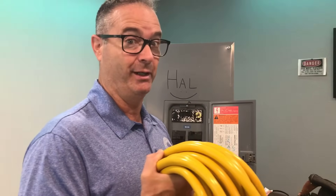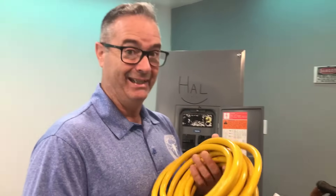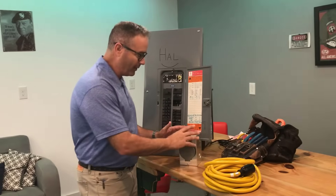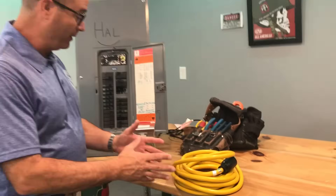Well, how can it be lost? It'll be in my garage, probably. Here's my definition of lost: when you need it and you're panicky, can you find it in less than a minute? If you can't, it's lost. Second part about the cord — get a longer cord than you think you need. For God's sake, don't be cheap. I have so many people who say, I want to save 50 bucks, I'm going to get a short cord and just park the generator right next to my inlet. My point is probably not. Where the generator has to go — you've got exhaust, you've got huge noise, they're so loud — and that spot right next to the inlet may not be level. A lot of the new generators won't run if they're not on level ground. Get a longer cord than you think you need. Give yourself some choices.